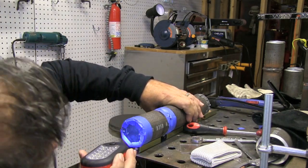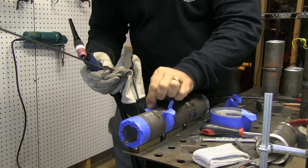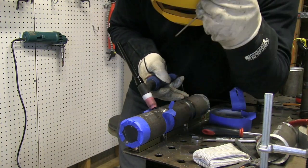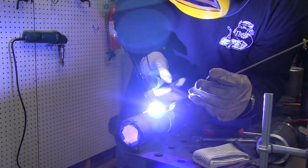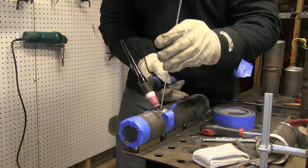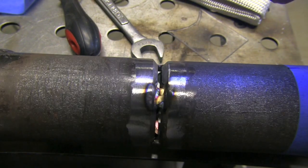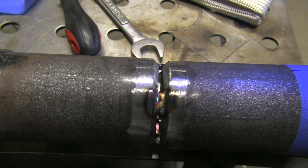Most people taking this test will very commonly have nothing but a scratch start air-cooled rig with no amperage control other than on the machine, so that's why I'm calling out amperage here. The amperage required is going to depend on the gap: an eighth inch gap is going to take almost exactly 75 amps, but if it's a little loose of an eighth it's going to take 70. If it's a little tight it'll take closer to 80, and as the gap draws shut you may have to bump it up five amps or so.